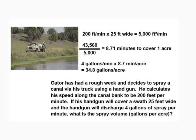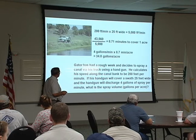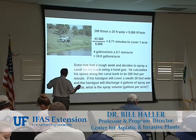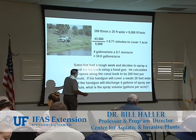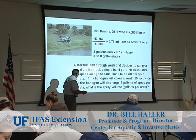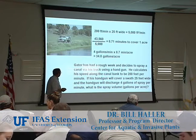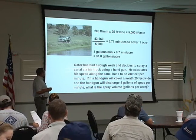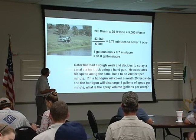Okay? Different ways you can do that, but you need to come up with that answer. And it's pretty simple. You get your area sprayed per minute. You know what your gallon discharge is of your pump sprayer, 4 gallons per minute, and it's just a matter of finding out how many minutes it takes to do an acre. It's 8.7 minutes, and you multiply by 4.